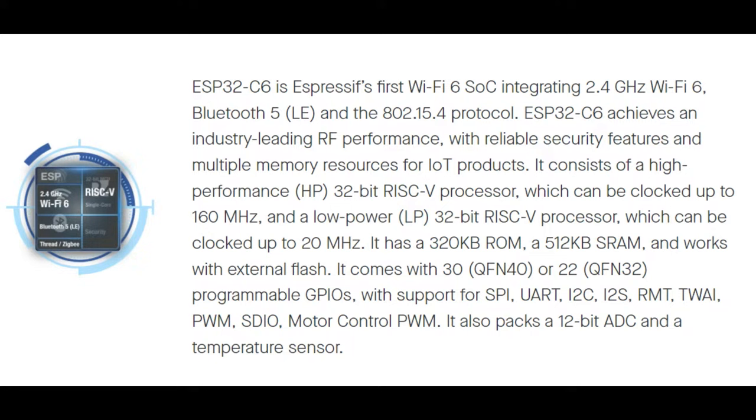So far there's no PSRAM support — I don't think the chip even supports PSRAM. So it's not meant for really big, processing-heavy IoT applications. It's meant for low-power, low-cost, light applications that still want all the peripherals you'd want with an Espressif chip. It also doesn't have as many pins as the S2 or S3 — it still has a lot, but it's got a little more than the original ESP32 and less than the S2 and S3.